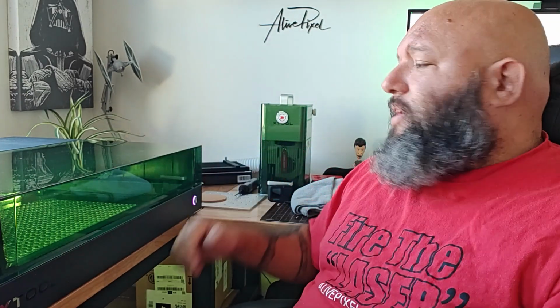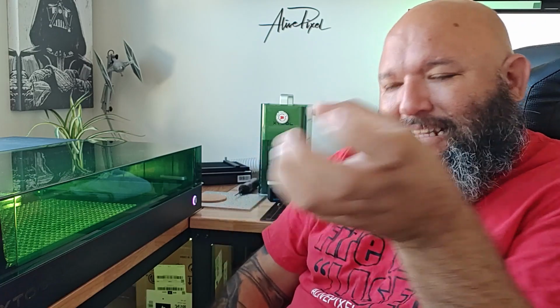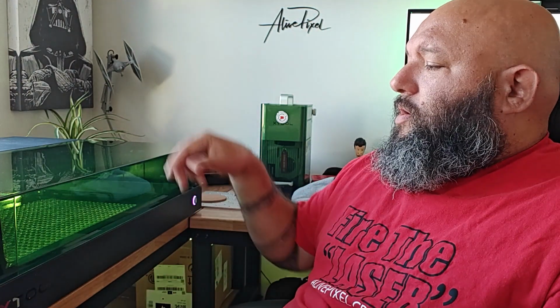It's really interesting. But finally, they go with the drag chains here, so no cables around, and that's perfect. That's now industry standard. Now, the way they swap the modules: I saw comments of people having issues with the module getting stuck. They took the screws out and they can't wiggle it out. Just tilt it a little bit on the front and pull it. It's a magnetic snap and it creates some force. When you get the machine with the honeycomb, it comes with these little pins, right? So you will imagine that this will go on the holes on the honeycomb and you hold the material.